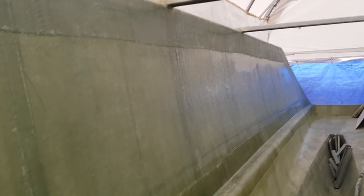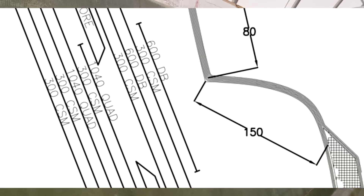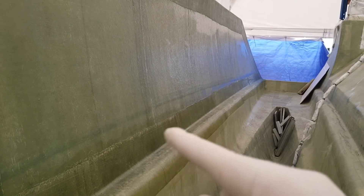A quick explanation of what's going on here. This wall is two 300s, one 1200, and another 300 quad 300 CSM - substantial thickness. On the flanges overlapping underneath, the foam is going to sit between here and the bottom one. There's a 40 centimeter wide trim, and that blank spot is where the foam will bond to and overlap onto that seam I'm laminating on right now. Very structural - strengthening the chines and the edge of the boat. A lot of extra work, but it'll give a really rigid line along here, with the foam overlapping down around five centimeters over the top.